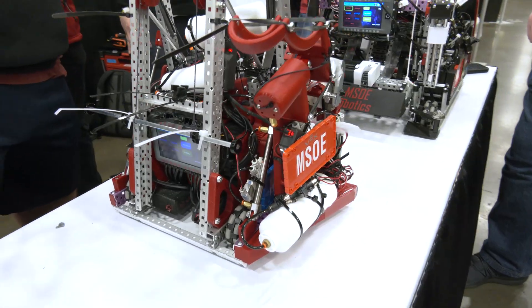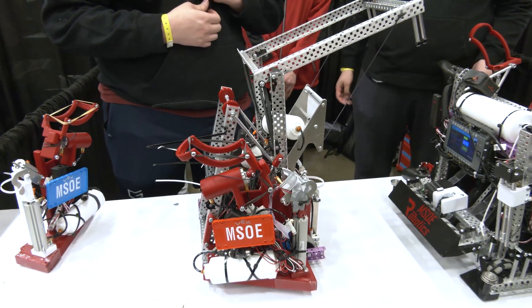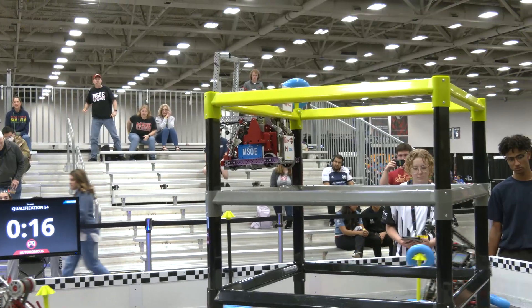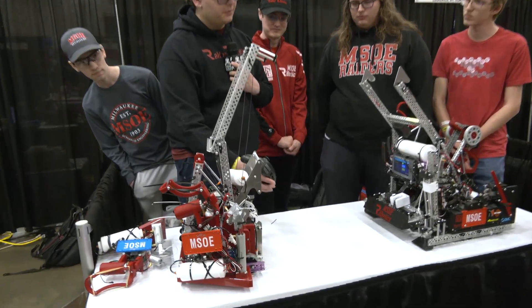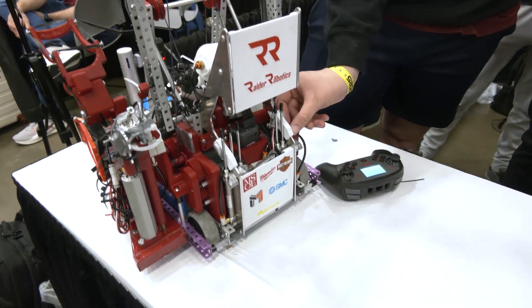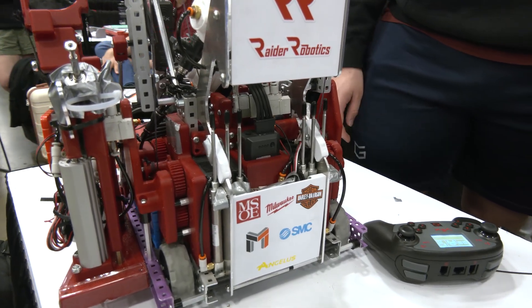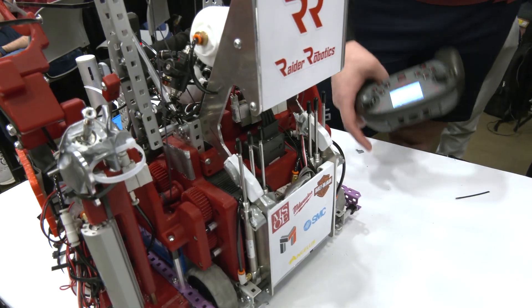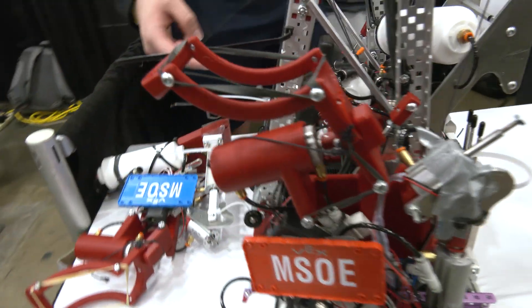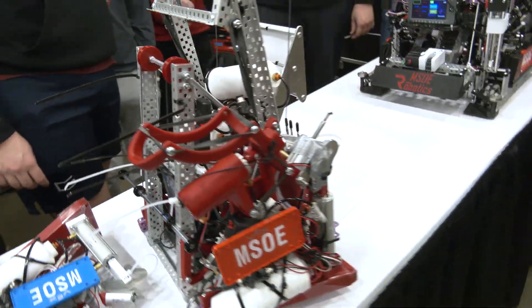We also get the high stake, which is worth eight points towards the end — basically the same as winning wall stakes. We found that the wing itself bending against the ladder isn't actually enough to hold both bots. So we have this array of pistons over here that presses into the bottom bar, which gives us about 60-something pounds of force on the bar — enough to hold both bots. These are isolated on their own switch so they don't use the same air as the rest of the system, ensuring we always get maximum pressure on the bar.